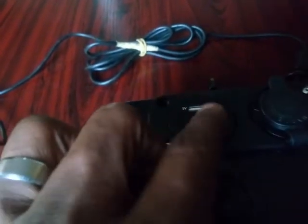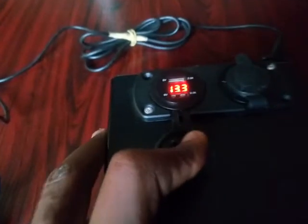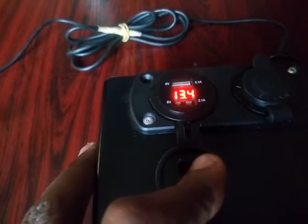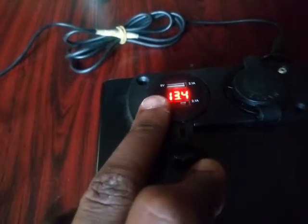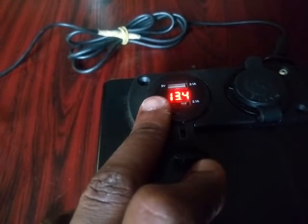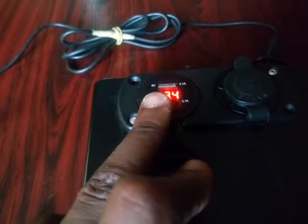In the middle there is a voltmeter. Let me switch this on so you can see it. You can see it reads 13.3 to 13.4 volts. This number tells you when your MPS is full — when it's full, it should read 13.6. At 13.4 it is approaching full.